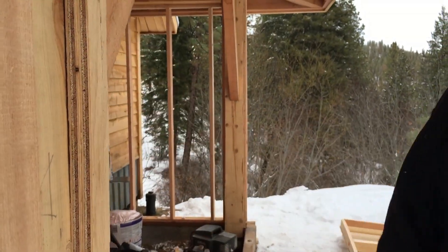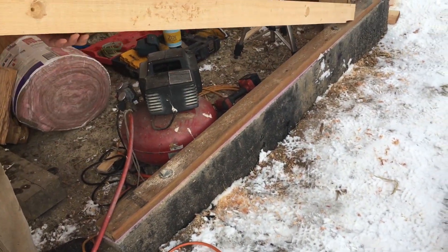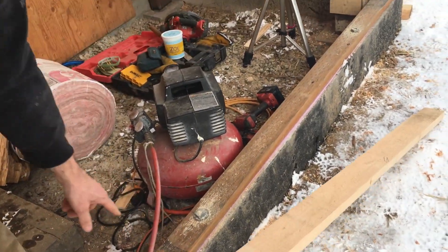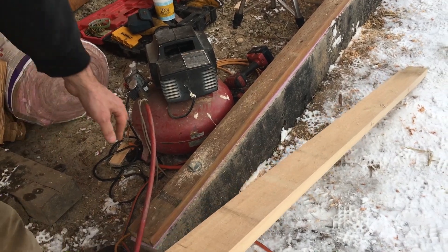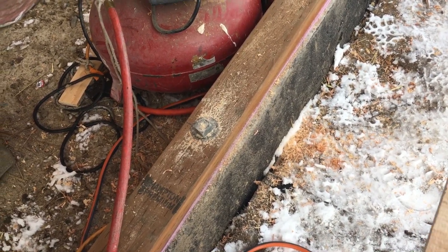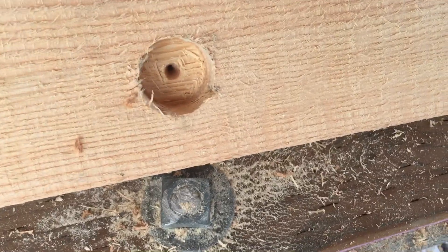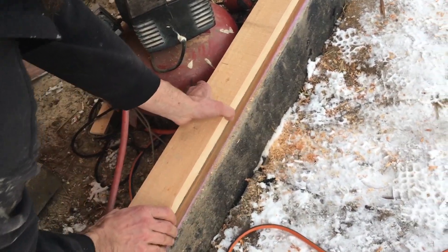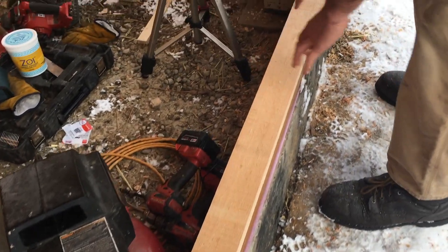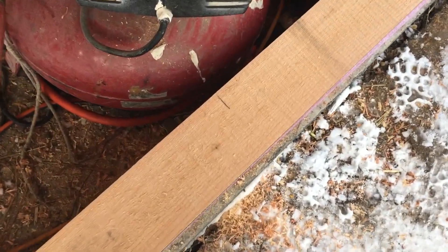Right through that and into the frame a little bit actually. So that's the posts all along the header. I start with the sill of each wall. On the stem wall I've bolted a piece of pressure treated two by four and the nuts stick up a little bit. I've cut them off flush but just the height of the nut is in the way. So I cut the sill of the wall and bore out for those and make sure that it fits over them, and then I can do all my layout right there in place and know that it's going to fit when it does drop on there.